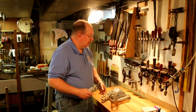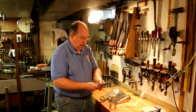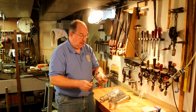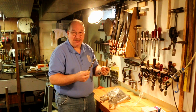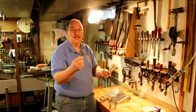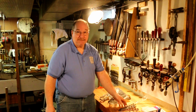You would think a guy with as many drill bits as I have wouldn't be bothering with another set. These five drill bits cost five bucks and they're all Irwin's. Irwin makes really good drill bits, and these look like the main bore series. These are newer ones — they're not called main bores, those were something you got in the 30s, 40s, and 50s — but these are just the same style. They're the single shank, double lip, really good drills. These need sharpening, but for a buck a piece, can't complain.